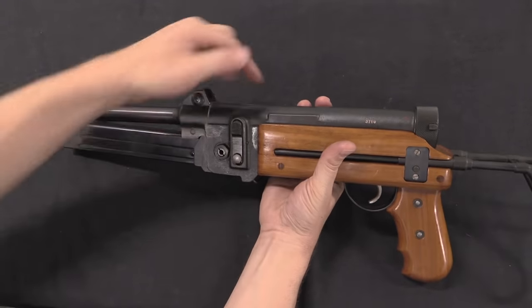There we go — there's the inside of the gun. A little bit of a simplified trigger assembly; there's no longer a manual safety. It's interesting to note that all of the cuts for the manual safety were actually made here, along with milling this flat. But I think it's pretty safe to say the safety was never installed, given that the safe and fire markings aren't on here and the parts aren't installed. I suspect this one may have been one of the very first, built on what was originally an MP46 receiver that would have still used the safety. We still do have this mechanical safety lever back here — that was a feature all the way back to the MKMO series — which prevents you from pulling the trigger if the end cap is not fully in place.